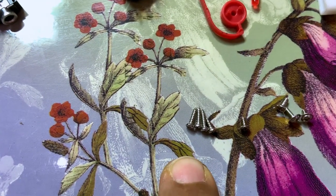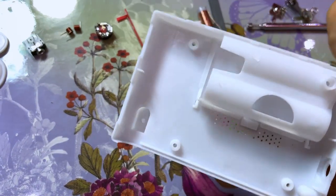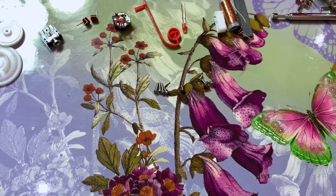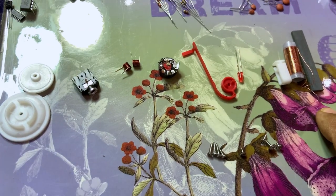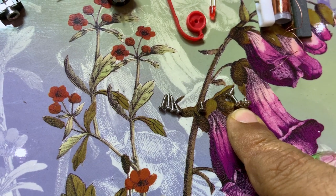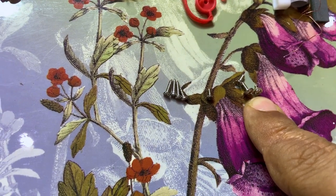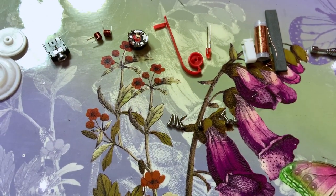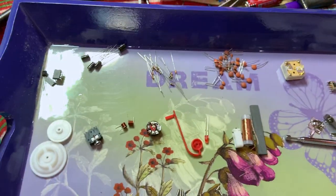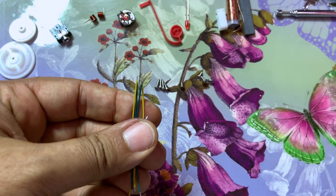This group is definitely for the cover to be installed. 1, 2, 3, and 4 are here, as you can see. In addition, 1 screw, maybe to hold the holder of the ferrite rod. We have 2 of those screws for the volume and tuning knobs. And we have 1 also to hold the antenna. You see now, after we group all these things, it has become easy for us to know about these components. It's very easy now. At least one step, we move towards the goal that we want.